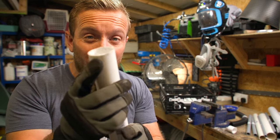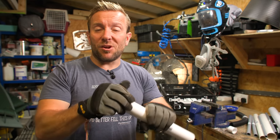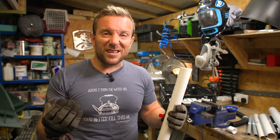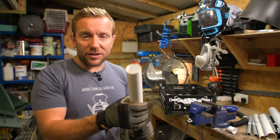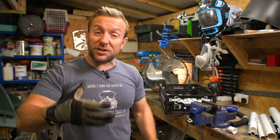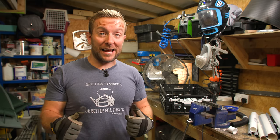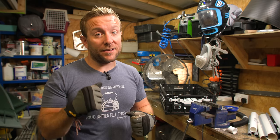Now the problem with that is, number one, we get lots of swarf on the ends of the pipe. The pipe becomes burred. Sometimes it's very hard to cut cleanly. Sometimes the cuts are slanted - they're not straight, they're not square with the pipe. Also, it's really wasteful - you end up with shavings all over the place and make your work area dirty. We then got round to using proper snips, almost like a set of scissors. The disadvantage with those is that you've got a very large blade that you can cut yourself on really easily. It's quite difficult to get that cut nice and square as well, and they take up quite a bit of room in your tool bag.